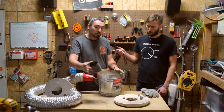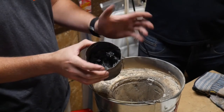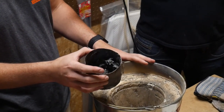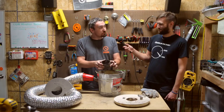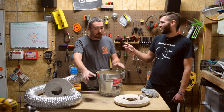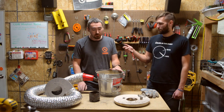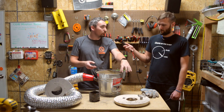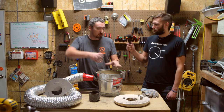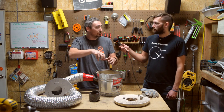My crucible is actually a disposable propane tank, like used for a lantern or barbecue grill. Definitely make sure it's empty first — it's precarious when you're cutting it open because there may be a little bit of propane left, so make sure it's thoroughly vented. I cut that in half, and that's what I used to cut the hole for the vent, just kind of wiggling it back and forth as it chews through the plaster of Paris and sand while it's still kind of moist.